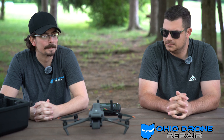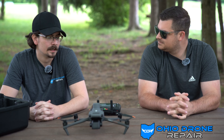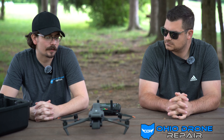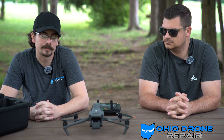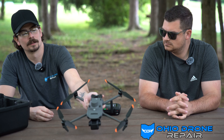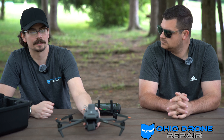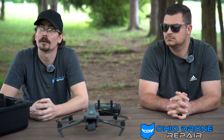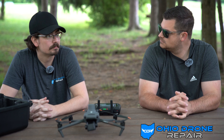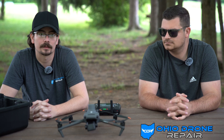Multispectral itself is cool, but that's really just the gimbal — everything else is just a Mavic 3. Any Mavic 3 you have — thermal, Cine, E, whatever — it's a very common drone. All they really do is put that different camera on it and throw the RTK module on it, which is always included. And there is a light sensor at the back. That sensor is how you tell the differences between bands of light depending on lighting conditions. Right now we have overcast, so these measurements would be different than if we had perfect blue skies with the sun overhead, and that sensor makes sure those things are quantified.